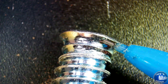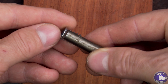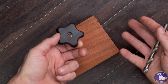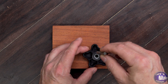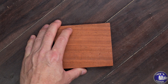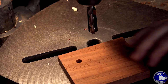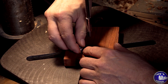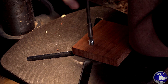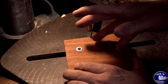These inserts also have a small collar at the top that keeps the insert from sinking deeper into the knob and really locks it down when tightened. You'll need a drill bit that's just slightly smaller than the threads, and you only need one piece of stock. It's very simple and won't take long. I'll place the insert to find center, drill a smaller diameter through the center, and drill my hole — setting the bit so it just barely pokes out through the bottom. The threaded insert I have uses an Allen wrench chucked up in my drill press, and I'll screw it in a little bit at a time. Just like that. Now we just need to cut some kind of handle and we'll be finished.